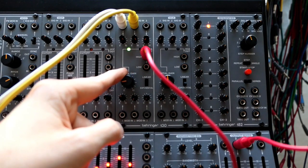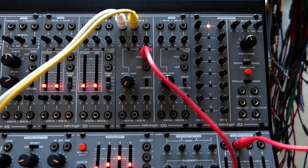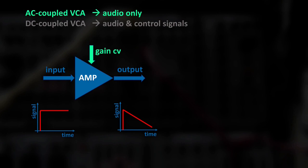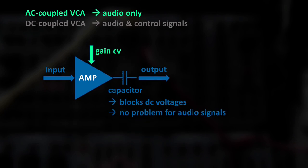If a VCA should process control signals, it has to be a DC-coupled one, since AC-coupled VCAs cannot handle constant CV signals, because they will pull their output slowly back to zero. This doesn't damage the VCA, but it is usually not what you want if you use your VCA to process CV signals. AC-coupled VCAs have an internal passive high-pass filter, which is just a capacitor, and this blocks DC offsets